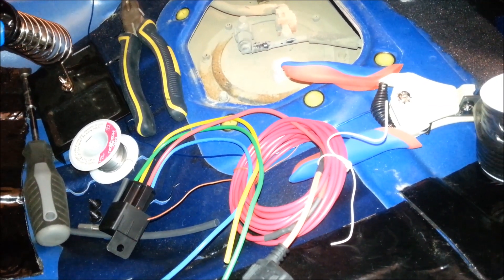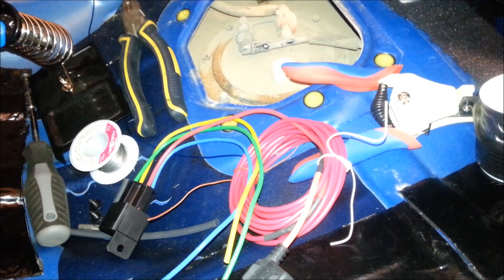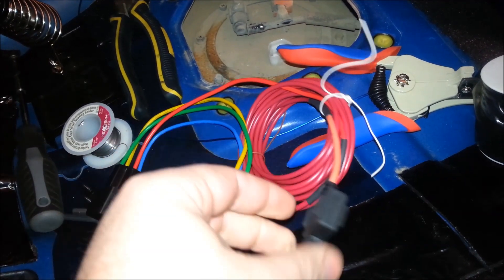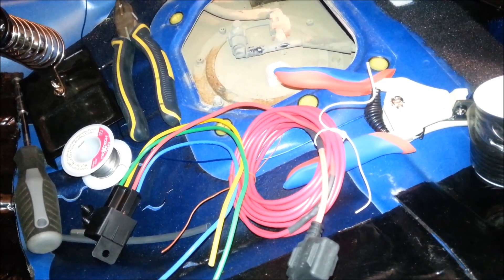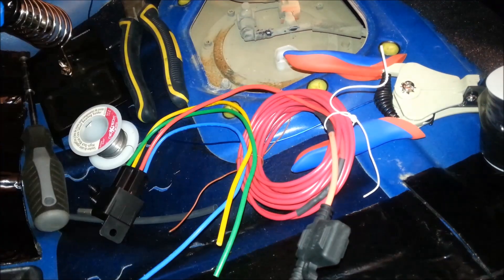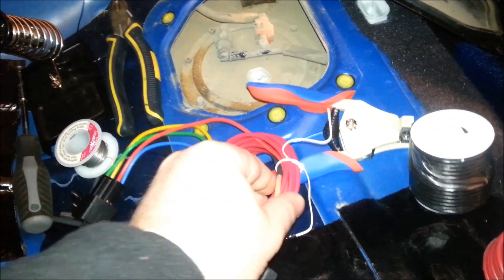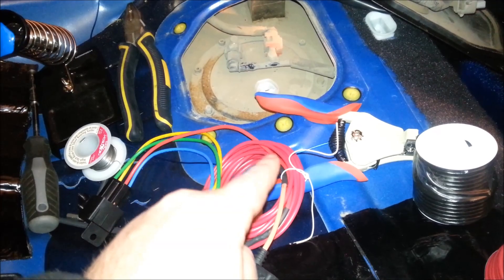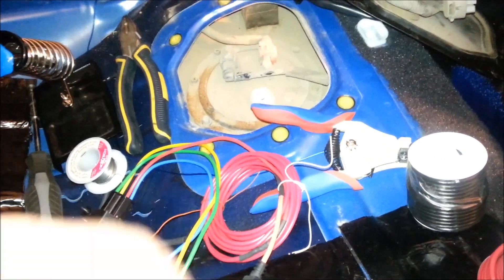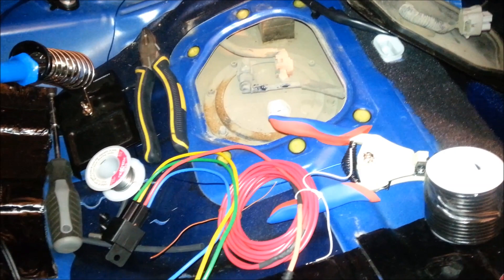In my case, it's very important to note the amperage of the pump that you're going to be using. So we will now talk about the fuse. The fuse holder should have a fuse in it, or you need to put a fuse in it. Looking at the specs of the Walbro 400, which is the pump that I'm going to be putting in, its max amperage draw is 22 amps. So I've opted to put a 25 amp fuse in there. The wire, in order to do this, is 12 gauge. You may need thicker wire depending on how many amps your pump draws. There is an actual flow chart on how to do it, and you need to also know how long your wire is. This is actually going to the 4 gauge wire that feeds my audio system in my trunk.